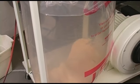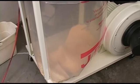The studio lighting makes this pretty hard to see, but I can see that the dust is essentially a wooden tornado inside the bag. I did notice that this is about as cloudy as the bag gets. The static in the plastic bag usually makes the real fine flour-type dust cling to the bag, but there is very little of it in here. That showed all through this evaluation that the Jet vortex cone dust collector does what it says it will — the chips are coming downwards into the bag rather than going up into the filter and reducing the air flow.